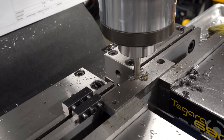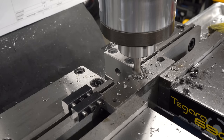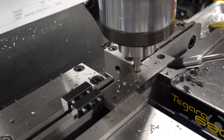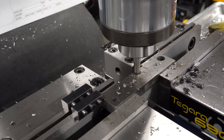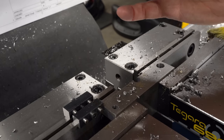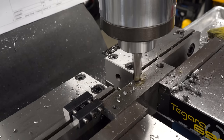I had the quill extended quite a way so I was a little worried about rigidity, but it's cutting nice and smooth - no chatter at all - even though the end mill is overlapping the edge of the part. I started small and figured I'd work my way up, but I probably could have just plunged to full diameter in one pass. Next is a half inch end mill - add a little bit of oil and plunge this thing in using the knee.